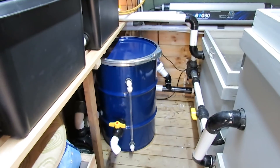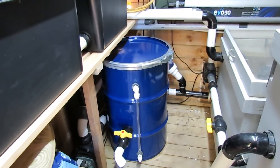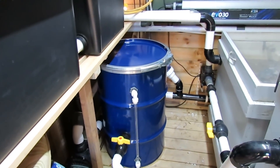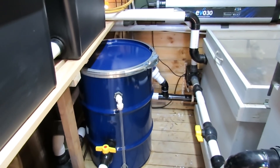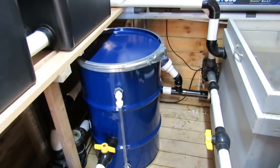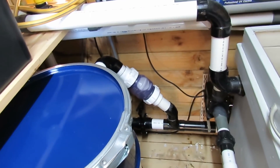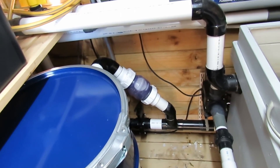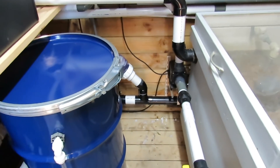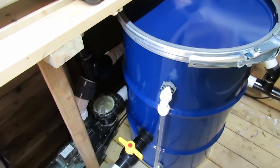It's all in and plumbed in. We were in bypass mode and we're now in pre-pump filter mode. It's up and running — it's been running about two hours now. As you can see at the back there, the non-return valves are wide open, we're getting a good flow through that into the top of the filter and out the bottom again. The pump basket is totally clean.